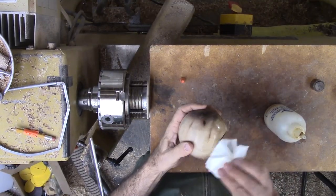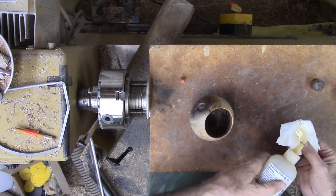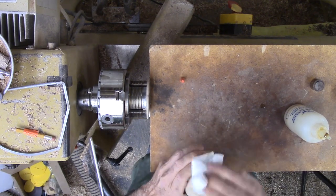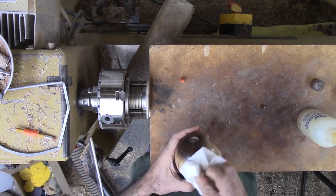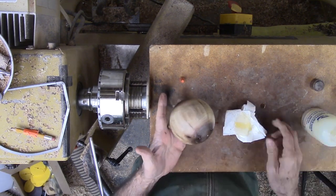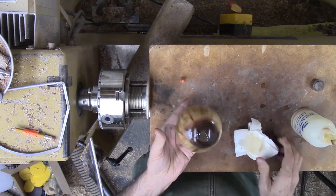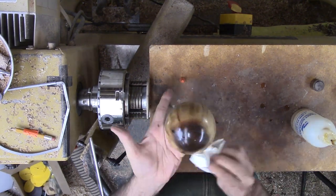This ornament is a bit larger than I like for shellac, but I will use shellac anyway since it is fast drying and blends easily. Buffing makes the sphere shine. Then go design and print a decorative hanger and stand. I regard these printed elements as my equivalent to paint or texture — they are not turned, yet they provide a nice decorative lift to the project. Epoxy holds it all together. My ornament candy container will provide tasty treats during the holiday season.